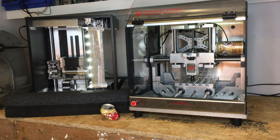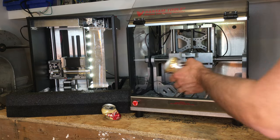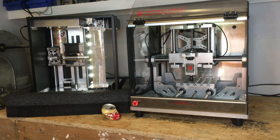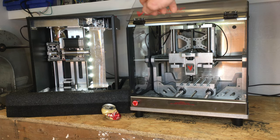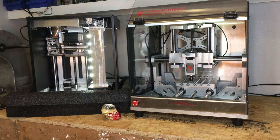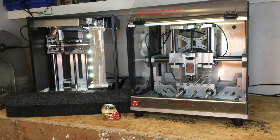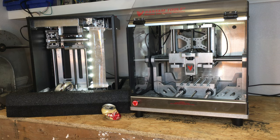So the dimple makes the can a lot weaker, if that is not entirely obvious. I'm not sure I want to wait for it to finish, so I think we're kind of done — I'll just turn that off. The can is dimpled, so I'm pretty sure this is going to work: G1 Y minus 100, same F200. And surprising nobody — look at the way it's crushing. It actually has some rigidity to it just by the way it formed, but this machine doesn't care because it actually has torque. Look at that, getting all crushed out. So yeah — Bantam: no torque. That's kind of what I was expecting.